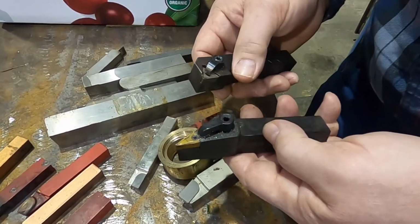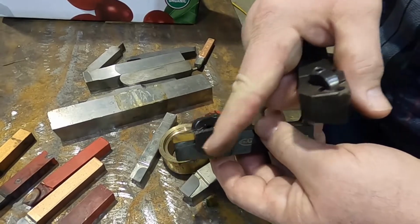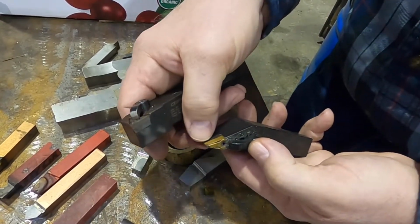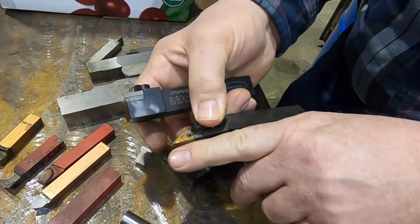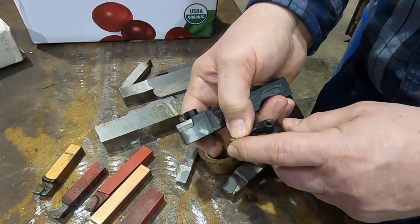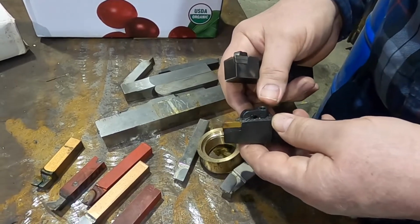I've talked with several machinists who tell me that once you put the insert in here, the cutting forces should hold it down. But I've had so much get pounded away different times. I just use things to extreme. And their argument is if there's a little bit of inaccuracy in the base, by clamping it you're causing a rocking here. So you're pushing it back here, and then when you go to load it, it can make it move a little bit from the force of coming down. There are some tools that clamp in the same direction as the cutting force here, but I don't figure that the base is inaccurate enough to be a real problem. I just want to hold it as best as I can.